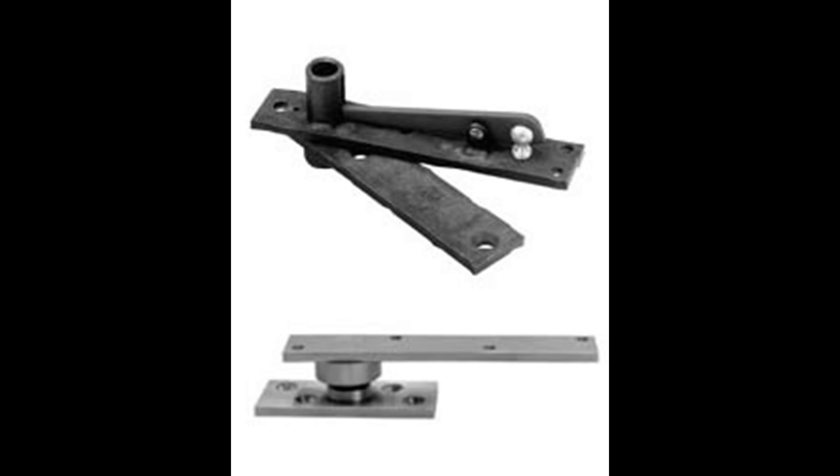If you have 5/8 of rock on the underside of the header, you're not going to have anything solid to mortise the top pivot to, even if you've got solid lumber behind. No — that would be a piece of wood there. Oh, you're absolutely good. My question was more: do I have room behind that face that I can mortise into and not have to see the leading edge of the wood? We want to make it trimless, but I don't want to get into sourcing weird extrusions. Just want to put a J-bead on the top of the opening, and the rest left and right is just a drywall opening with corner beads.